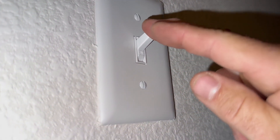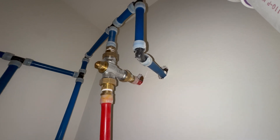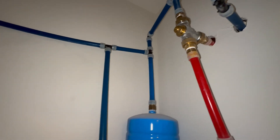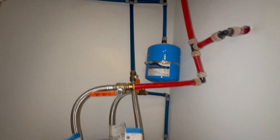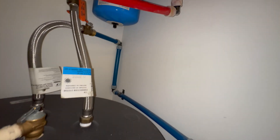Turn off the quick disconnect to the fan coil. Now I'm in the water heater closet looking to isolate that heat coil only, but all I can find is a return valve shut-off for the heat coil. I can't find the hot water supply shut-off to the heat coil because it's not there.